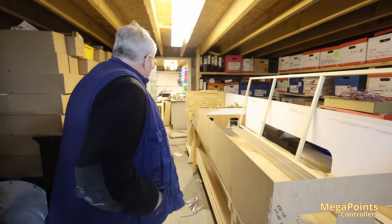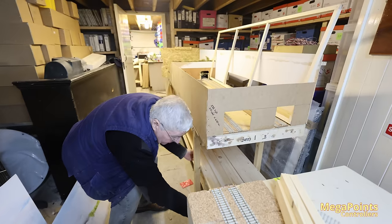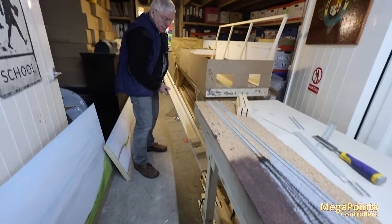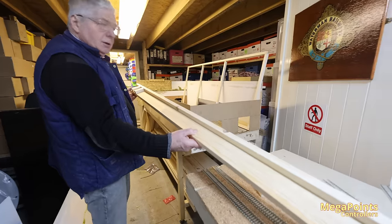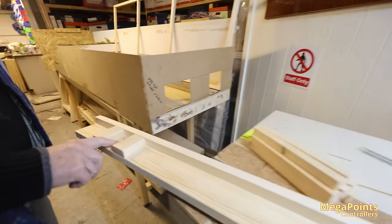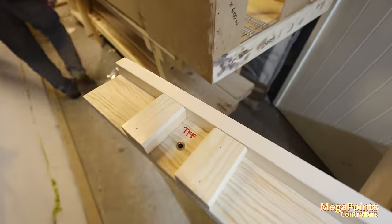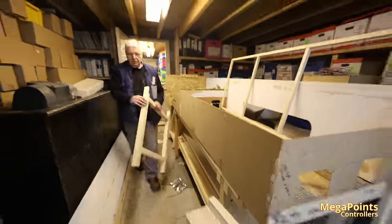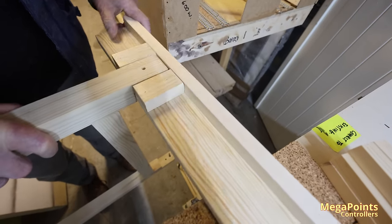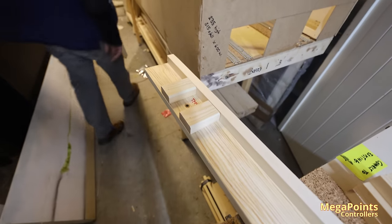Oh, good. You're under control by the looks of it. Well, yeah, these are the beams. They're all done already. Just get one out and show you. I made them easier for the legs to go in now. Just got a socket in them, so there's no nut needed now, just a bolt through there. So it's captive? Yeah, it goes in. You've seen it before, Dave. You just drop in there now. Like that. Just one bolt now and a washer. And that's it, so it's a pretty quick job now to put them up.